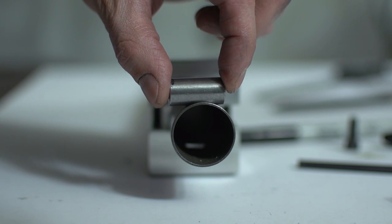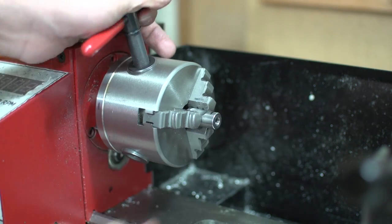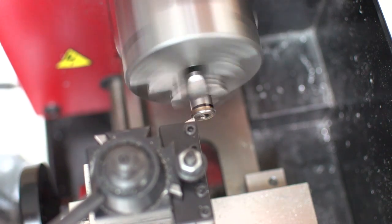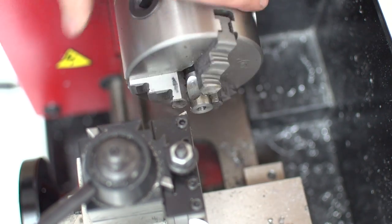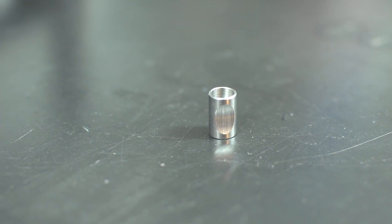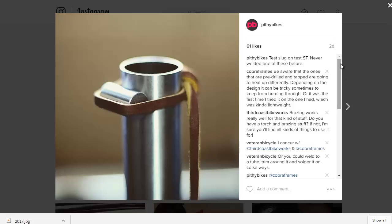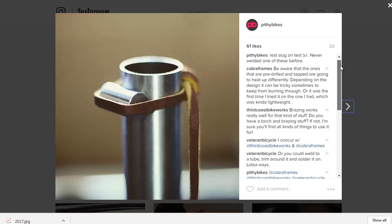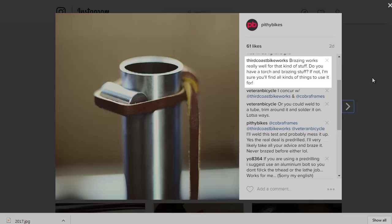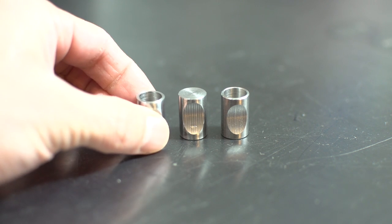Out of curiosity I compared it to one of the frames I chopped — the Paragon binder is a bit larger. I assume this is to give us the option to trim it down to a desired size. I marked one end off where I'll trim it, and then marked the center for where it will be mitered — never did one of these before, but cutting in two millimeters seems about right. Here's how that looks on the seat tube. Now I'm trimming the excess on the threaded side. I posted a pic of it on Instagram and some folks had some great suggestions. Joe says be aware that the ones that are pre-drilled and tapped are going to heat up differently. Third Coast Bike Works says brazing works really well for that kind of stuff. And Veteran Bicycle agrees with those guys.